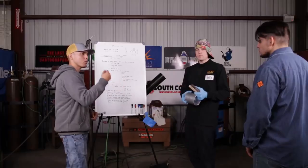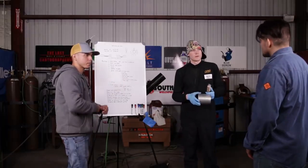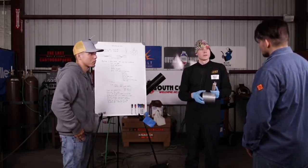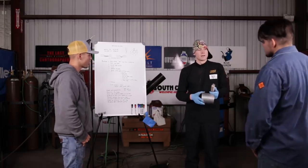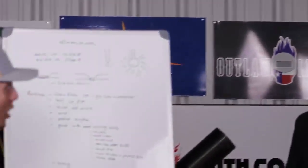Okay. Abraham, you had a question for him? What wave would you be using? Right now I just have it on advanced. Okay. So, foot pedal. Recommend foot pedal. A foot pedal does help because right now we have high frequency and arc, essentially because aluminum melts at a very low temperature. I believe the melting temperature is like 660, something really low.